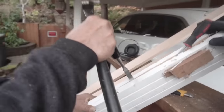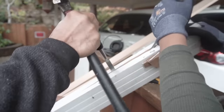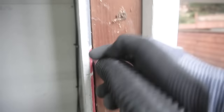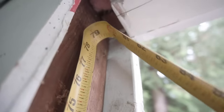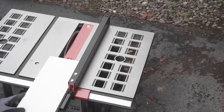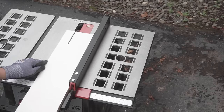I'm trying to see if I can pry off that door stop - that little piece of wood strip - to reuse it, but unfortunately I don't think I can because it's starting to tear apart. So make sure you vacuum and clean out all the voids. In this case I'm cleaning out this half-inch void inside of my door jamb. The past owner who installed this actually put door shims to fill in those gaps.